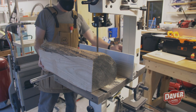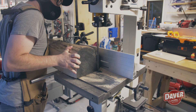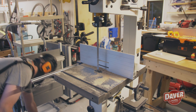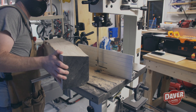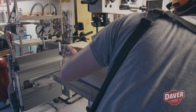I'm also using the stock blade that came with the bandsaw because I know it's at the end of its life and I didn't really care about ruining it. I figured this might be the last hurrah for that blade — why not go out with a difficult job. I did debark this log and will debark the next log as well before milling it up. What I'm trying to do is mill it into somewhat of a square shape, but I screwed up as you can see on the top — it is so wonky. When I was pushing the log through, it started rolling on me and the blade started wandering, which is probably not the safest thing to do.